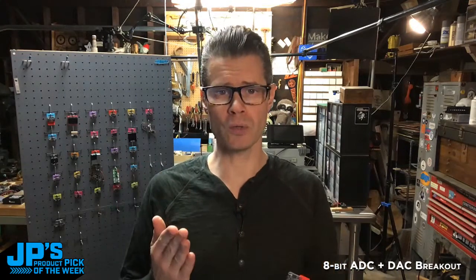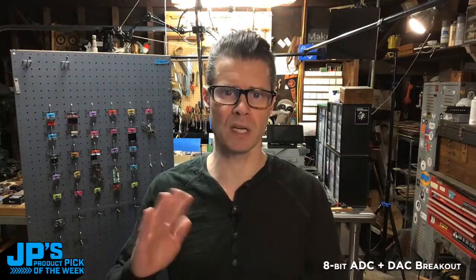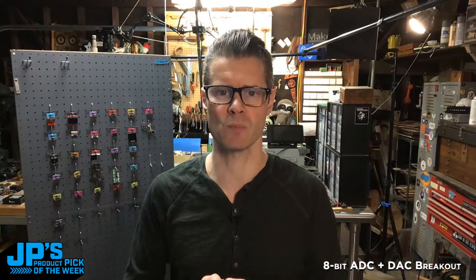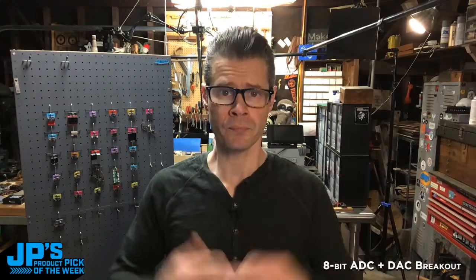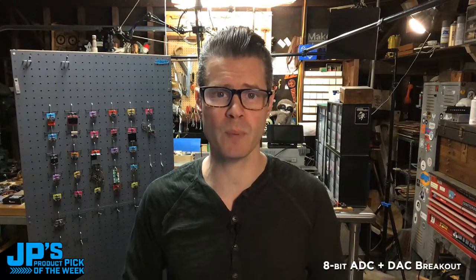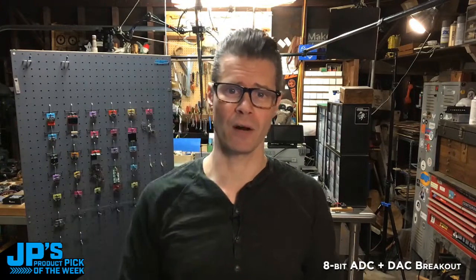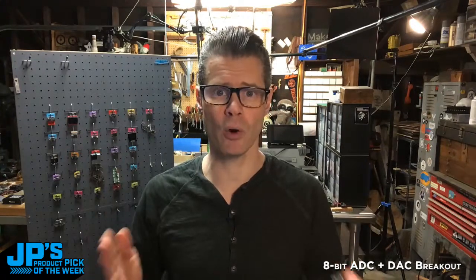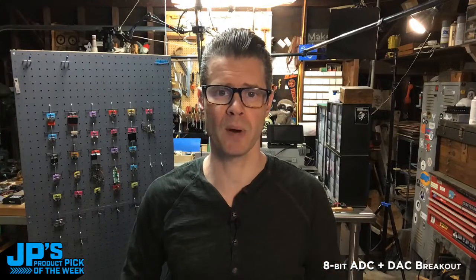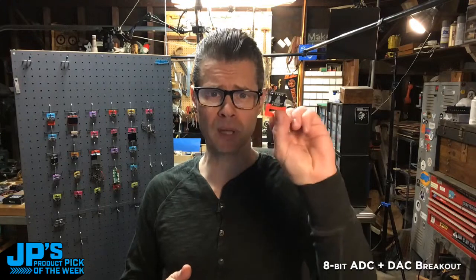And you don't always get that many analog inputs on a microcontroller. Sometimes it's limited to 2 or 3 if it's a smaller board with fewer of the pins broken out. And one thing you've probably noticed if you've done any work on Raspberry Pi projects is you generally have 0 analog inputs. There's a lot of GPIO for digital inputs and outputs, but you don't have any analog. So here's what you do. You plug this in.